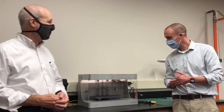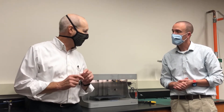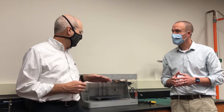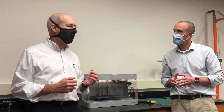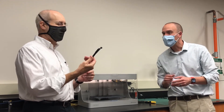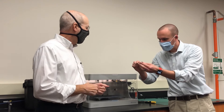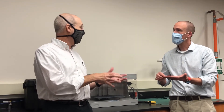One of the things we use for building is a 3D printer. This is our Markforged Onyx One 3D printer — it uses nylon reinforced with chopped carbon fiber, which makes it very, very strong. It prints in very fine layers — four thousandths of an inch — so you get a very smooth surface finish and really strong, great-looking parts. Here's an example of a small hip replacement, actually the size for a dog, that we printed out. It's lightweight but super strong. It's great for building any kind of mechanical parts without needing machining — a great way to take parts designed using computer-aided design and actually realize them very quickly.